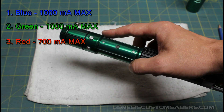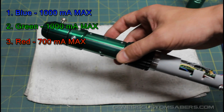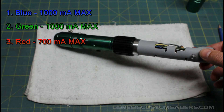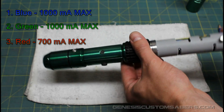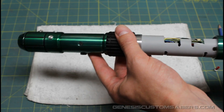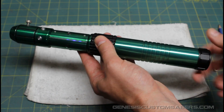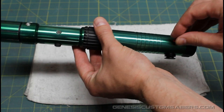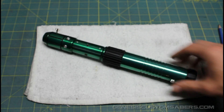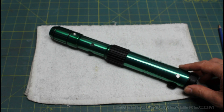The red channel, channel three, you don't want to exceed 700 milliamps. When you're playing around with the RICE getting your custom colors and custom flash-on-clash, just keep that in mind — because if you push it too far, you could pop one of the dies, most likely the red. They're a little more sensitive. If you push it over 700 milliamps, you could pop the red, and then this saber would have to be shipped back to me and entirely taken apart to replace the LED, which would take quite a lot of time. This saber has taken a long time to build. So to close: when your SD card is back in, pull the kill key, and the second half of the saber just screws back on. It lines up nicely, kill key goes in, and that is this Halo-themed saber. Thanks for watching, and I hope the client really enjoys this high-end, one-of-a-kind saber.